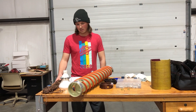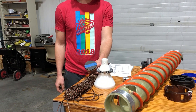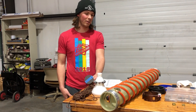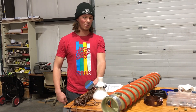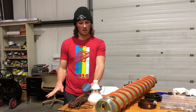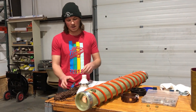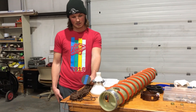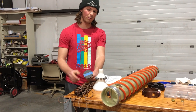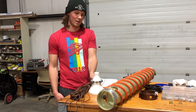If things go wrong, there are a couple of tools we ship with the hand auger. I always recommend using a hole cover when drilling — when you bring the hand auger out, immediately cover the hole with a piece of foam or plywood. It's quite common to drop small metal pieces or fumble a screwdriver, which can easily bounce down a hole. If you realize something is down a hole, stop drilling immediately — don't try to core through it, you'll just damage the cutters. Your first best option is the recovery magnet: a high-strength magnet on some paracord. It's not always foolproof but it's a good first step to recover small metallic items.